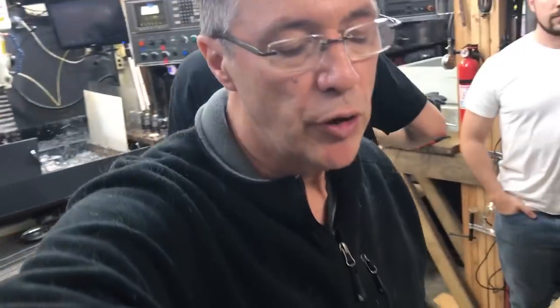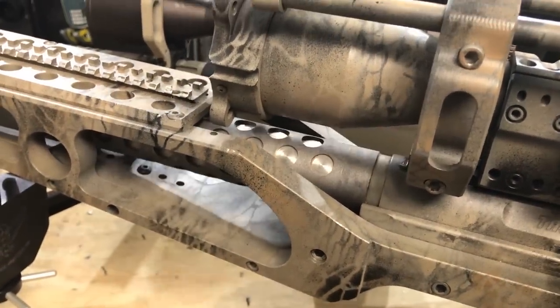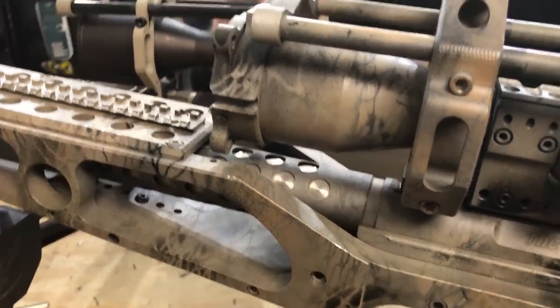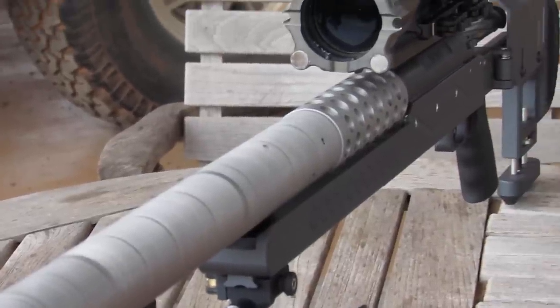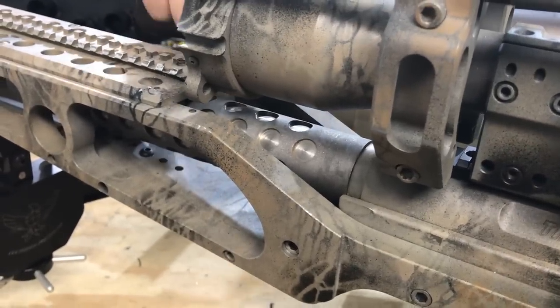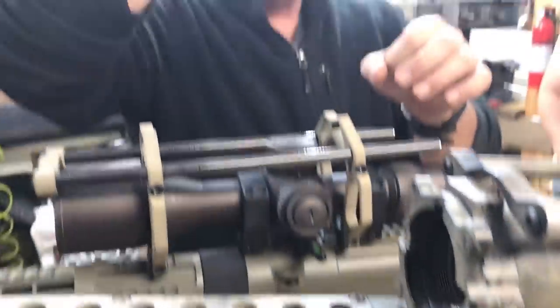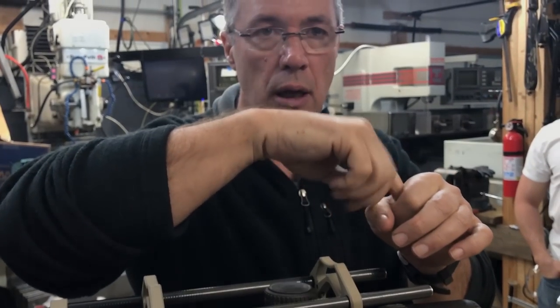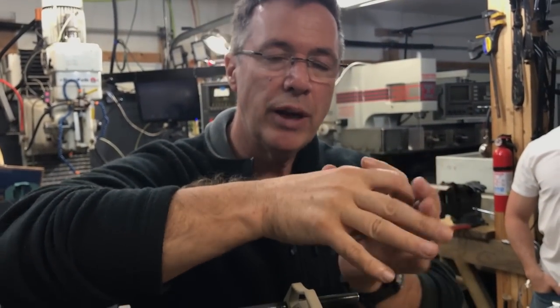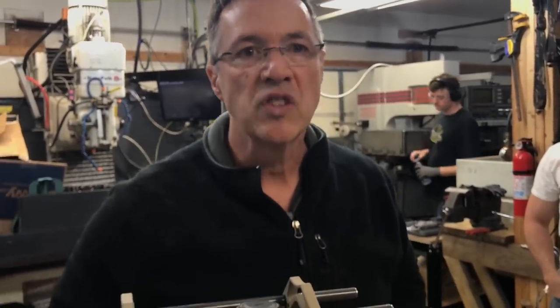As far as the patterning on the chamber area, the actual cores come down at the end of the box from 1½ to 2 inches before the end of the brass case. Therefore, we're looking to keep the maximum material in place for the explosive event. Behind it, I don't need that full mass, but by boring it out, I have removed weight, increased surface area, but I still have the original diameter. It is still extremely strong, still extremely rigid for its size.